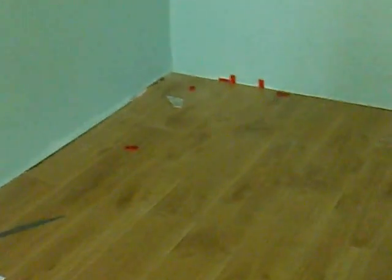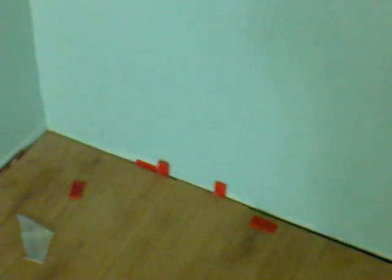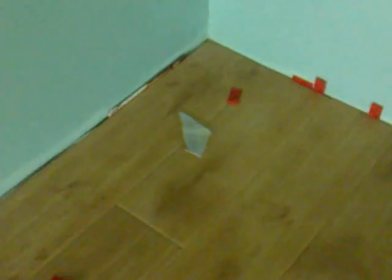to the underlayment. So we start off with the first row. We keep about 1/4 inch spacing. You get spacers, or you can use these free things that they give you at Home Depot or Lowe's to mix the paint, and put that on the side and kind of get you about 1/4 inch. And you lay down the first row right over there. That's the first one. And you lay it all the way to the other side. Now you'll have a small piece of wood left on the other side, which you basically start off with the second row. Second row onwards, pretty much the installation procedure is the same.